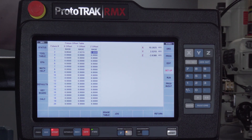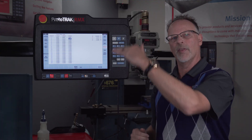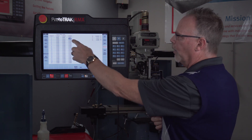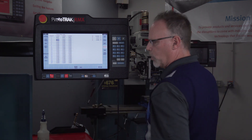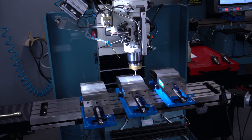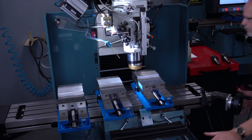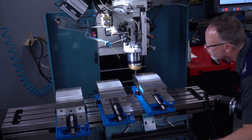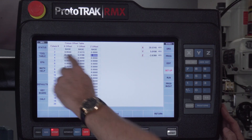I should mention that all the tops of the parts are at the same Z zero, so I don't have to put a fixture offset for Z. But if I had three different height parts, I would have to touch the top of my tool off of each part — tell it the base for the first fixture and then tell it the top of the part for the next two, and they would be entered as offsets here. I'm going to go to fixture number three, same process — there's the number. And like so, one more time. There are my offsets for my two fixtures.